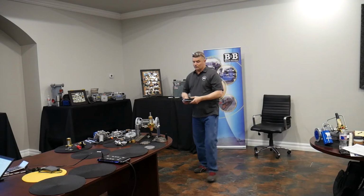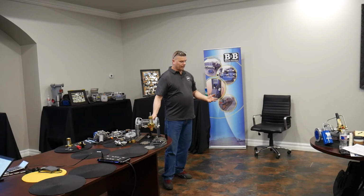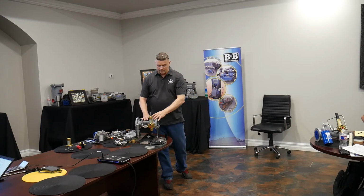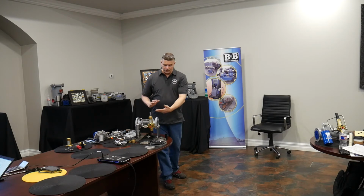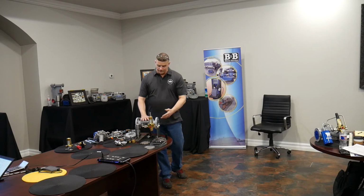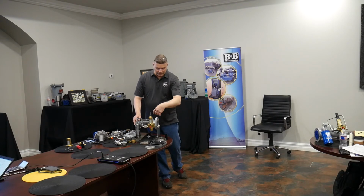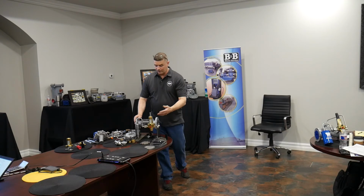One of the things that we teach when somebody calls us and is trying to do troubleshooting, and we're trying to teach them what to do about it, to determine, is it a body problem or is it a pilot problem in that instance? It's relatively easy. I need to isolate the two. So what we'll have them do is basically disconnect this inlet tubing, spin the pilot off. It's really easy in A position, by the way. You don't have to do any of this.